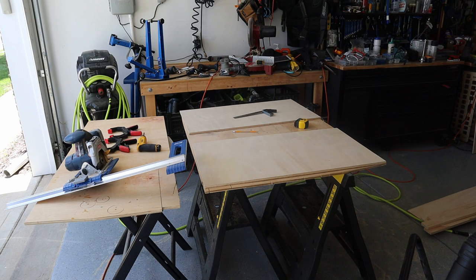We've got our two sides now — 35 and a half inches tall and 19 and 3/8 inches deep, which will end up being 21 inches deep with all the framing on it. What I'm going to do now is cut out the toe kicks: a 3-inch by 3 and a half inch toe kick on each side.